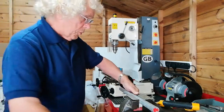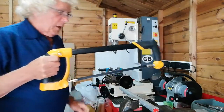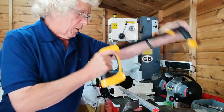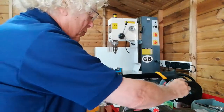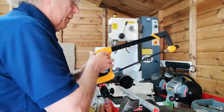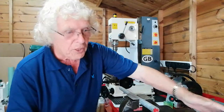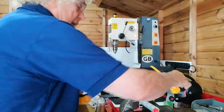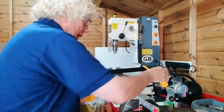This is a hint and tip for those of you not used to working with this kind of material. You'll notice I'm on this side of the vise because I'm generally right-handed. If you're left-handed, you cut from the other side — it's safer. Because I'm cutting to the right-hand side, if the piece falls quickly I'm tending to go away from the vise. A left-handed person trying to do it from this side would be putting the weight the wrong way, so they need to get to the other side and they're not likely to catch their hand on the vise.